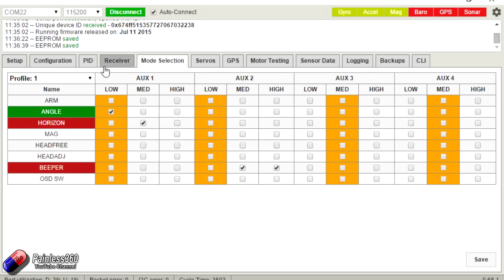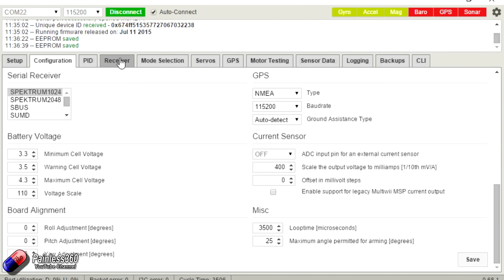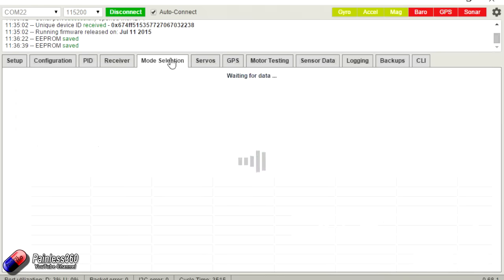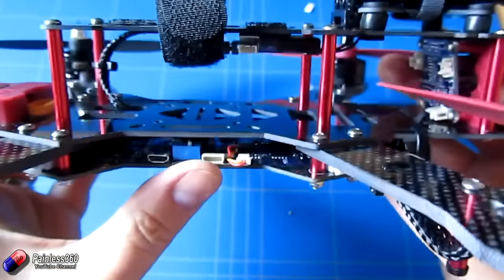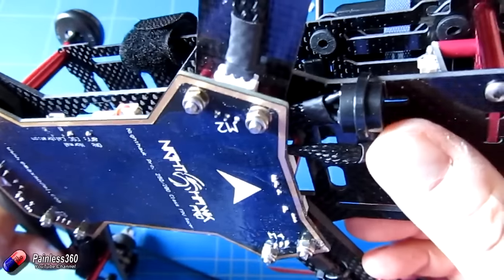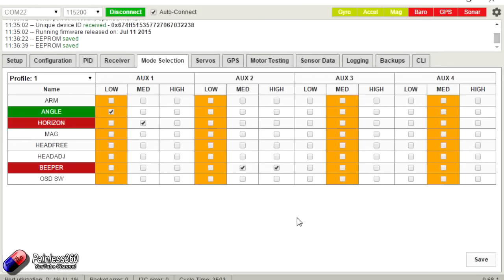It's pretty straightforward and easy. Just make sure two things are done: first, when you first plug it in with the buzzer wired up, the beeper will go crazy — don't panic, that's a great test that the beeper is working, it's just because 'enable battery voltage monitoring' is turned on. Uncheck that, hit Save, then jump into Receiver and make sure you can see a channel moving that you're not using for something else. Once you've spotted one, go into Mode Selection and under whichever auxiliary you've got moving, set it up so that in a particular switch position it activates the beeper. This is a very useful addition because if the model comes down in bushes or long grass it can be a nightmare to find — with this you just flick the switch and follow the sound of the beep.